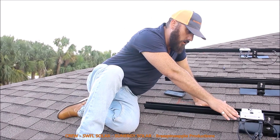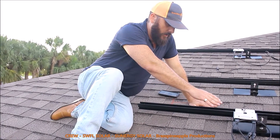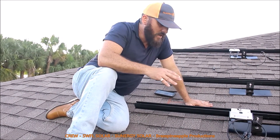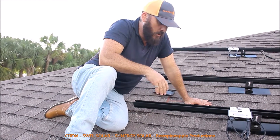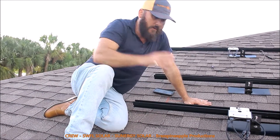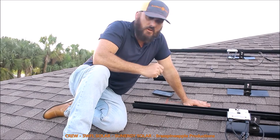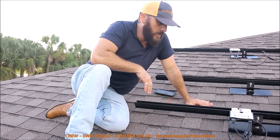These over here are the optimizers for the SolarEdge. This is for the inverter — it's really the most important part of the solar system. SolarEdge allows your panels to overcome shading. That's the strength of using a SolarEdge power optimizer inverter. So if there's shade on one panel due to a cloud, leaves, or something like that, it won't affect the rest of the system the way that a normal string system would.